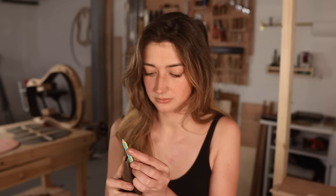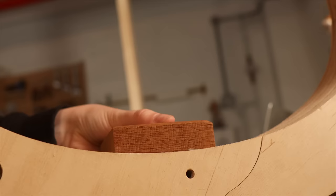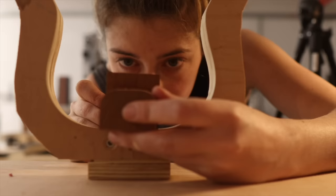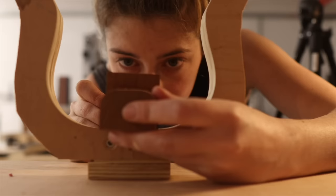The second trick is taking an ordinary pencil and turning it into your best friend when it comes to measuring out tough corners. If you plane down the pencil like this, what this does is remove the thickness of the lead and the bottom of the pencil when you're trying to mark an accurate line. It's really simple and effective and a great way for tracing contours accurately. You might have seen this in the ukulele build video — I use it when fitting head and tail blocks accurately.